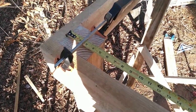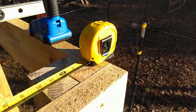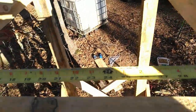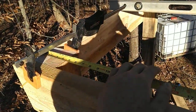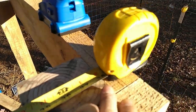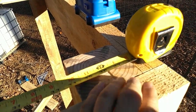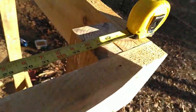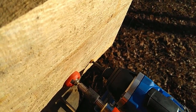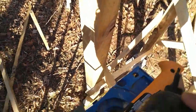Here I'm showing the clamping mechanism — I've got a speed clamp here and a screw clamp there. I go through, put one in, get it tight and flush with the outside. I'm making sure that my posts coming up are level, and that I have my 38 inches needed for the IBC to sit on top of these 4x4s. Now that I've got all these in, I just need to tighten the screws.